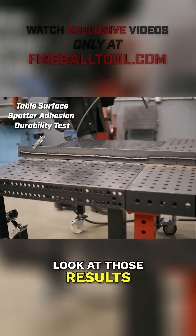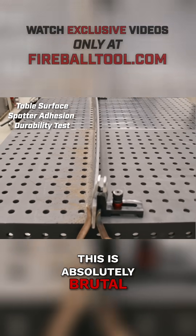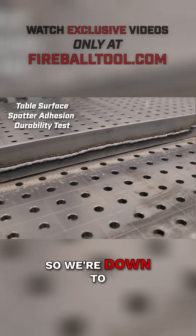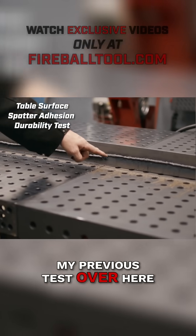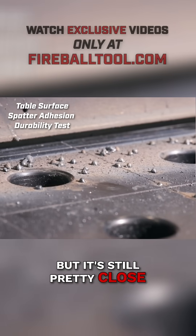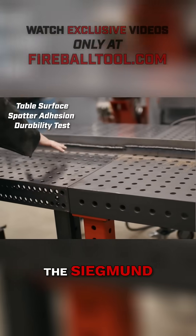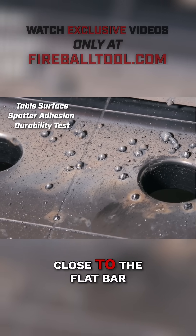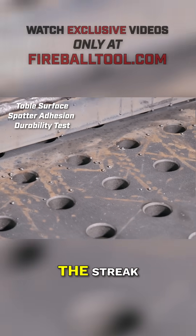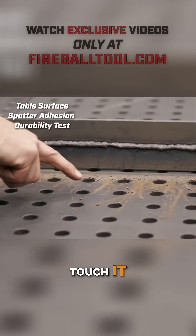Wow, look at those results — that is a hideous weld. This is absolutely brutal. I got off by just a skosh on my weld, maybe a half inch lower from my previous test, but probably not a big difference. The other thing I'm noticing is how much farther out the spatter is on the Fireball versus the Sigmund — the spatter on the Sigmund is really close to the flat bar. I haven't wiped anything off yet, just making observations. See how far it traveled and then stopped? I don't think it stuck — nope.